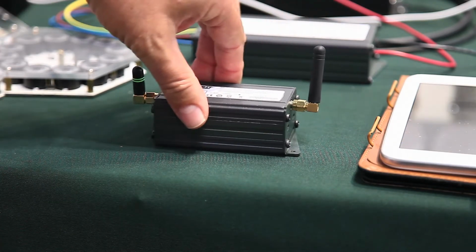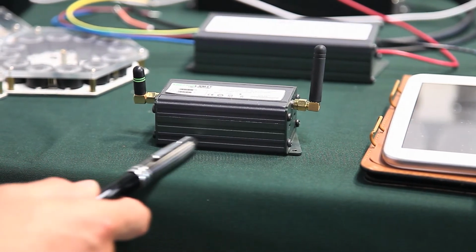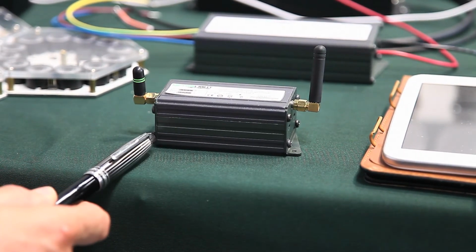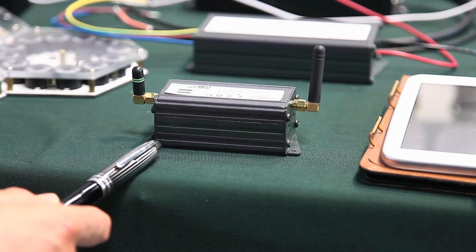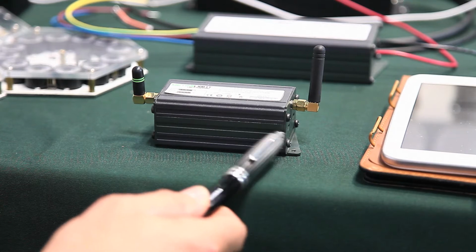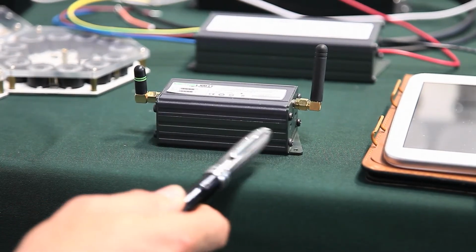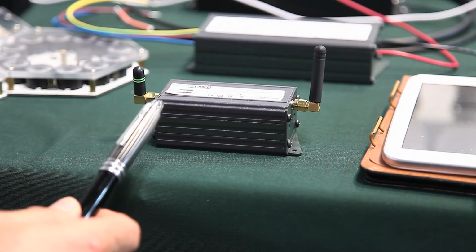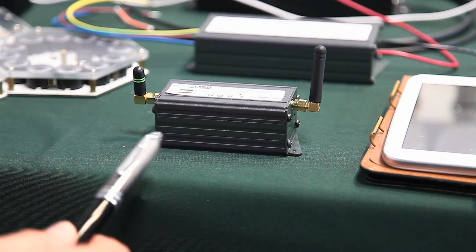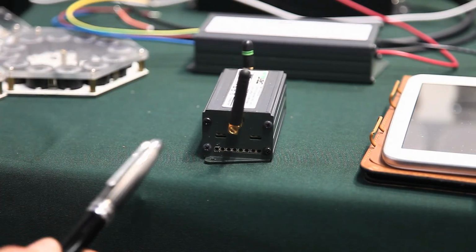The DLD is built up like a Lego, in 3 layers. The first layer that you see here can provide 2 channels independently. If you use a second layer, you can provide up to 6 channels independently controlled. And the third level is for providing the full communication protocol.